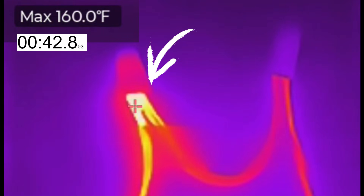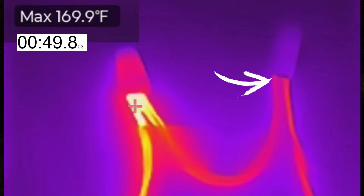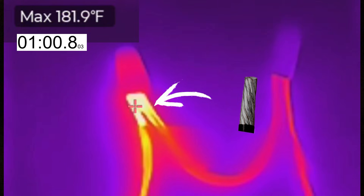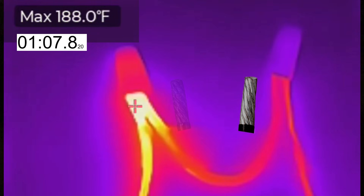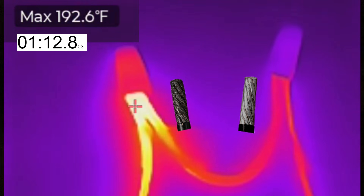The splice on the left is what happens down the road with time. We have two things going on here: oxidation and creep. The end of the aluminum wire where the fresh splice was just made was stripped back to very clean aluminum, so it's very shiny and new looking. The other end of that aluminum wire on the right, however, was stripped back probably about three or four years ago, so it's been sitting out exposed to the atmosphere and the moisture in the atmosphere, and that creates oxidation — in short, it's pretty dirty wire. That creates resistance, and where you have resistance, you're going to have heat.